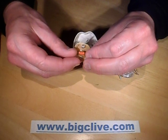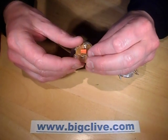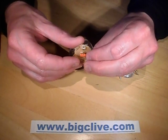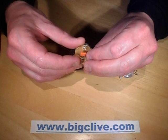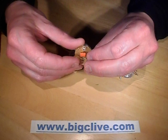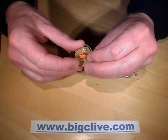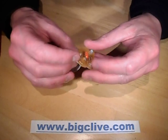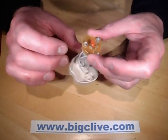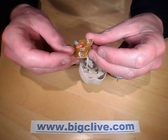That's very small text. 0.1 — my guessing is 100 nanofarads at 100 volts. That can't be right because the peak mains voltage is 300 volts. So that — well, it certainly is a very small capacitor.